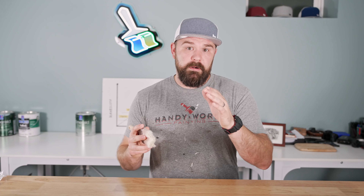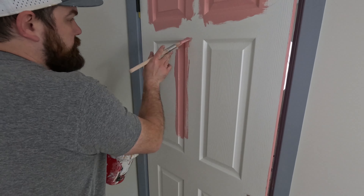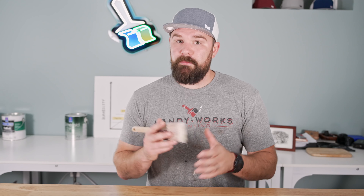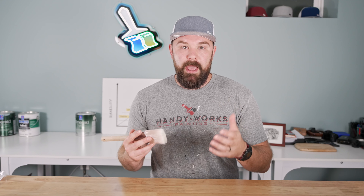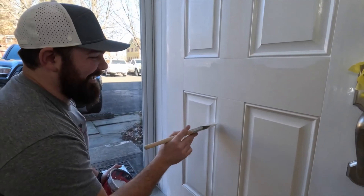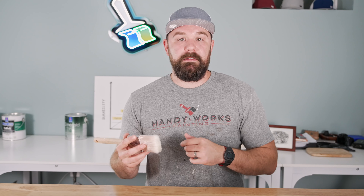Best use scenarios for hand brushed finishes: anytime you have a six panel door with a grain pattern, it looks way better hand brushed following those patterns. Also louvered doors with slats — a sprayer is easiest, but if you're not spraying, hand brushing is the move since it's very hard to get in there with a roller. If the door's already been brushed, keep with that pattern and try to clean it up. The other most common scenario is front doors — most folks like their front doors, they've often already been brushed, and it's just the more classic look.